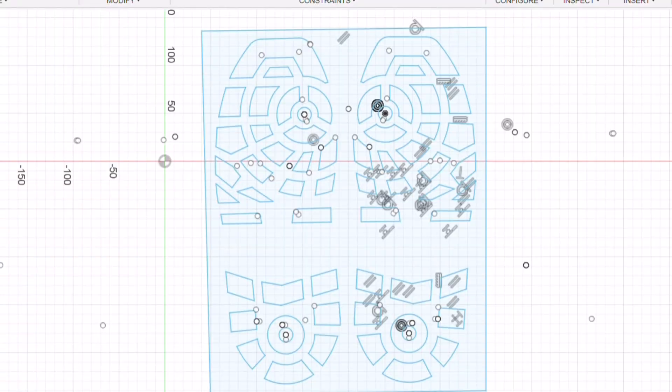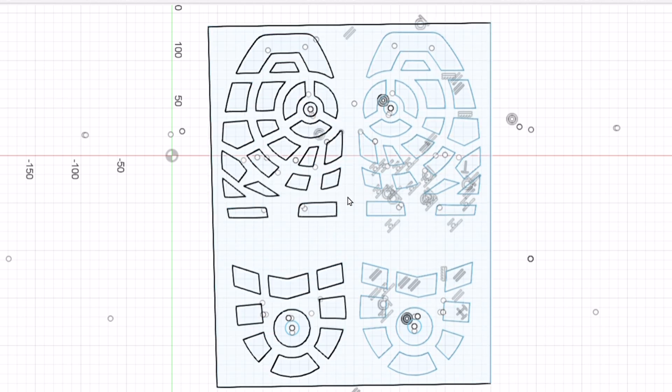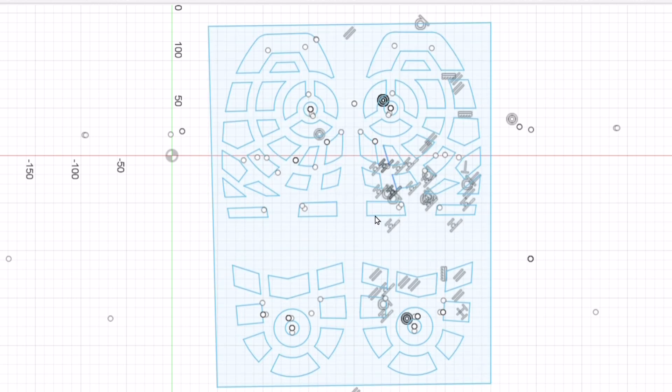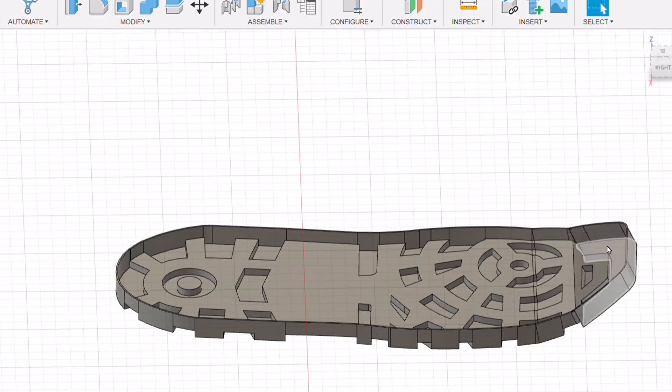Looking at the previous sole, I've CNC machined these out of wood or plastic. The problem is I have to cast the high-abrasion rubber resin into the tread pattern, wait for it to set, lift it out, then shape it with toes lifted up, and then put Kevlar and carbon fiber with resin into it to cast it into the proper shape. Instead, I want to 3D print a mold in the exact shape needed — with toes curled up slightly to ease movement. Because 3D printing is so cheap, I can make the mold sacrificial if necessary, since getting rubber resin out of a mold can be very tricky. Here's the new mold for the treads — it curves up nicely on the end and has a wall around the edge to hold the resin, carbon fiber, and Kevlar.